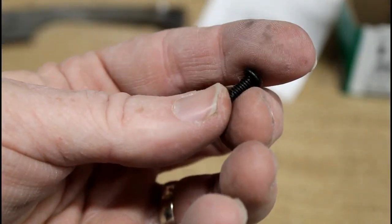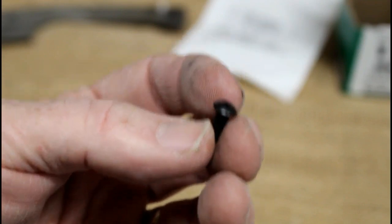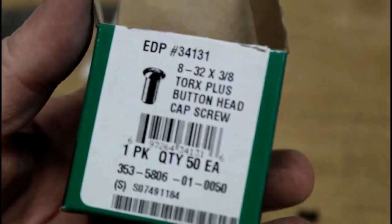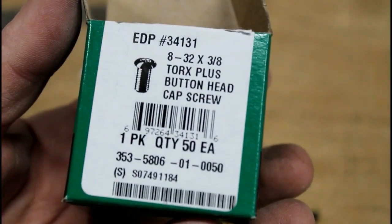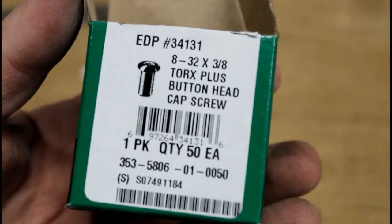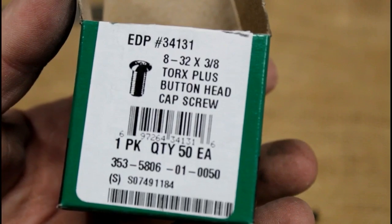We're going to use these small black 8-32 cap screws, and this is the part number. You could actually freeze this frame and capture that information. I got them off of McMaster-Carr, but you could find them from Grainger or from a variety of other sources. So these are 8-32 and they're 3/8 long. They come in a variety of different lengths.